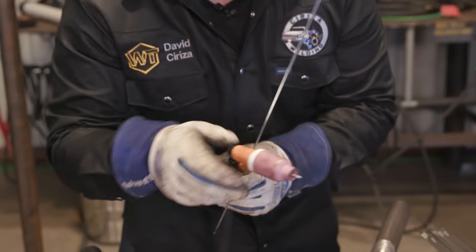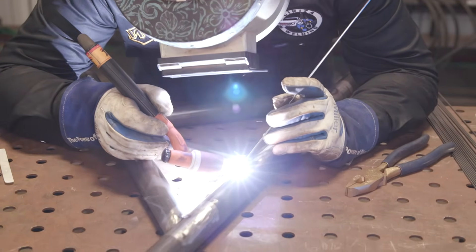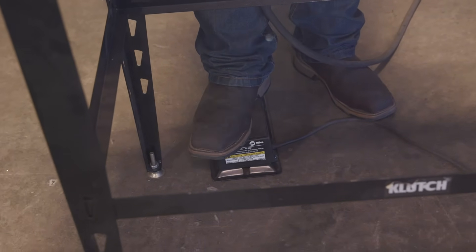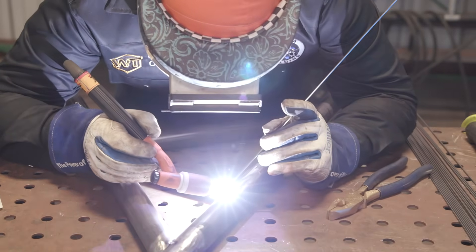It's also nice to have this flexible gun — you can bend the angle you need to put your hand comfortably and adjust yourself. Be careful, the piece is hot. Properly heat up that tack, don't start prematurely. Wait for your puddle to form.